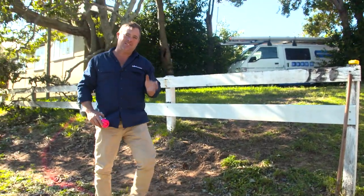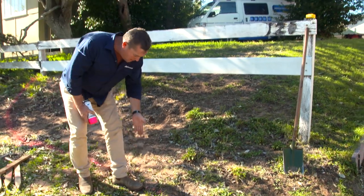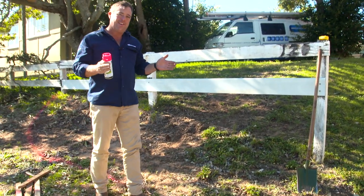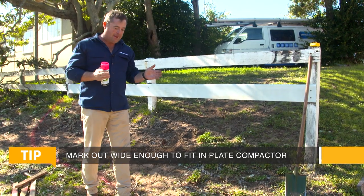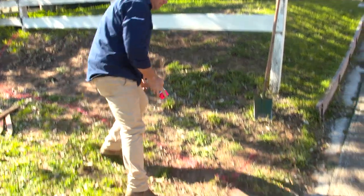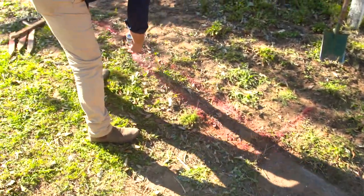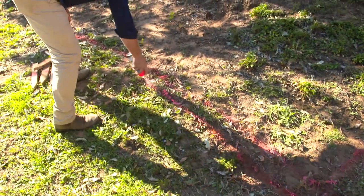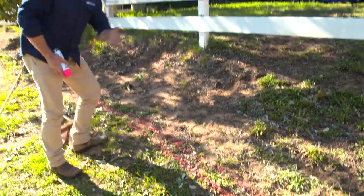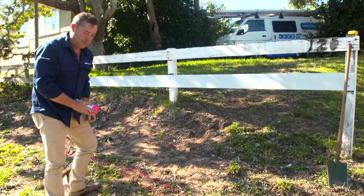Now that line represents the face of my wall — in other words, it'll come from here up that way. With the footing underneath, I need it to be wide enough to pick up that plate compactor. So I need to go in front of the wall and behind the wall. Simply tracing about 150mm in front of that line will mean my footings will come forward, the wall sits in the middle, and that's the strongest position it could possibly be in.